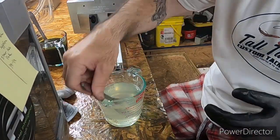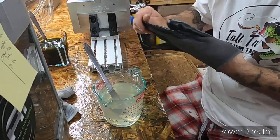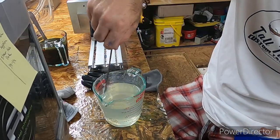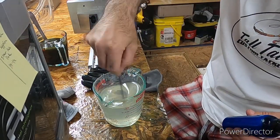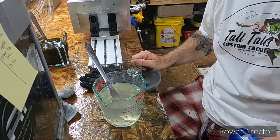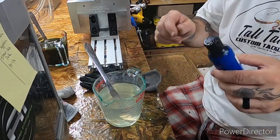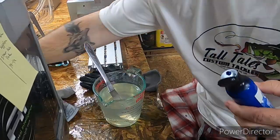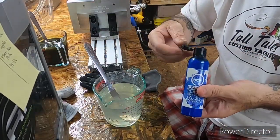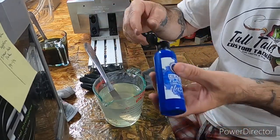whatever. And always remember, I didn't say it before, when you're heating your plastic up, don't just get it up to 350. Get it up to 350, stir it real good, scrape the sides, stir it around really good, and once you hit that, put it back in the microwave a couple more times. Honestly, most of the time, I like to heat it up to around 350, 360, 2 or 3 times to make sure that it is good and cooked, because if you don't, you're going to end up with plastic that's got sticky, or it's just not going to work right.